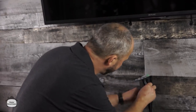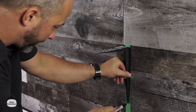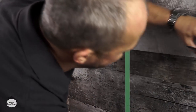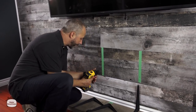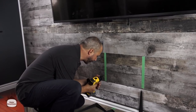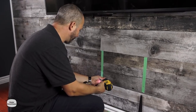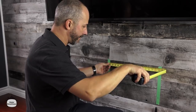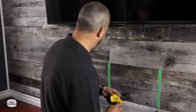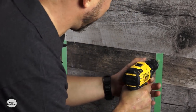No matter what you do, you've got to put hardware into the wall — don't use plugs. I'm going to use this to measure my spot. We're going to start by pre-drilling with this bit to make sure that we actually have a stud there. We're going to make an adjustment here and double check. That's wood — confirmed.